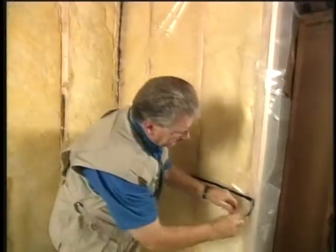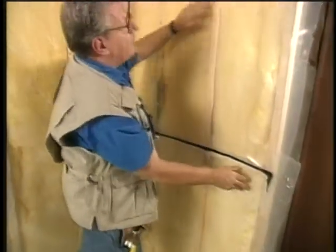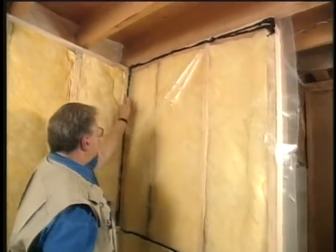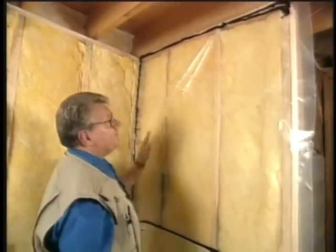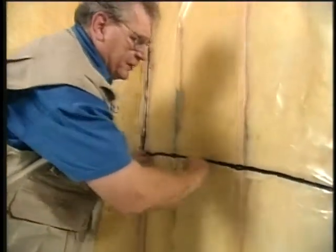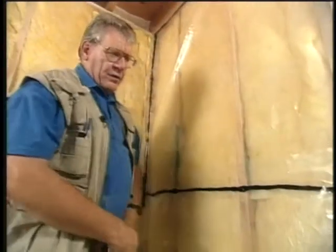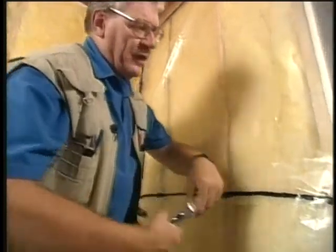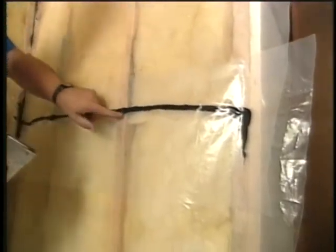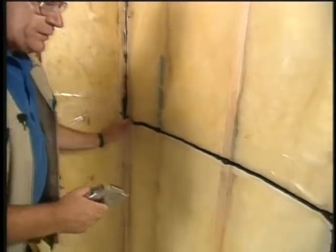Here's where the polyethylene vapor seals come down under the wall, up and terminated at this point. We've added vapor barrier to the top of the plate and sealed it in with acoustic sealant caulking. Down and overlapped one foot, also put the sealant to seal that seam, giving it a good tight vapor seal. Now all we have to do to finish this wall off is staple it — always staple right at the point of the acoustic sealant as you can see here, so it squeezes nice and tight and seals it at the point of where the staple is.